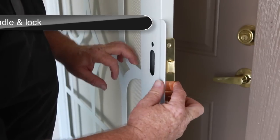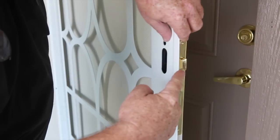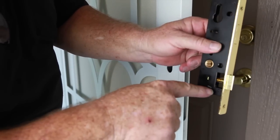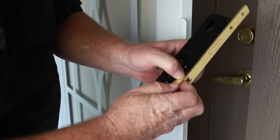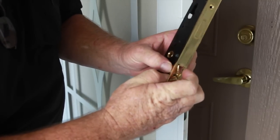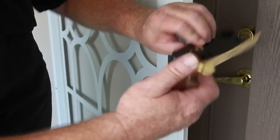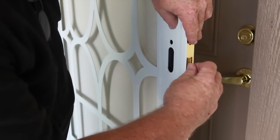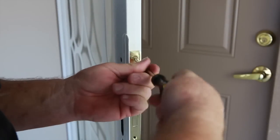Place the latch mechanism into the door as shown. Note: the slope side of the latch should face inward. If not, remove the lock assembly and rotate the entire piece vertically 180 degrees so the latch is on the bottom. Push in the latch until it's fully recessed. Rotate the latch 180 degrees as shown and push back through the faceplate hole. Next, rotate the lock assembly 180 degrees and place back into the door with the latch on top and the slope facing inward. With the latch facing the proper direction, fasten the assembly to the door using the screws provided.